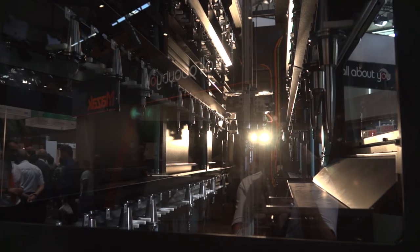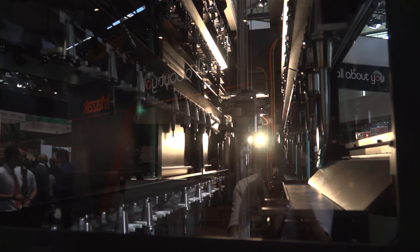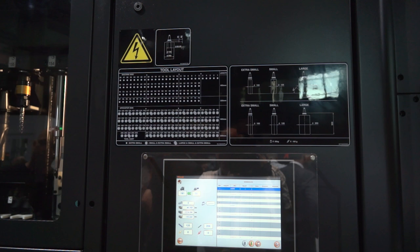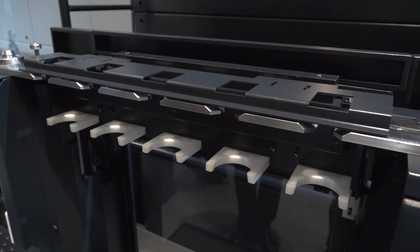The tool pre-setter can be linked in with our Smooth Tool Support. The tool ID chip allows us to record the measurements of the tool from the pre-setter against it. As soon as this is loaded into the machine, the information is read from the reader and that data is automatically loaded into the CNC. You could have any number of these with all your tools sitting waiting? Yes — you can have two tool carts per machine, or a number of these exchanging tools between machines for flexibility.